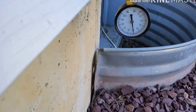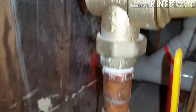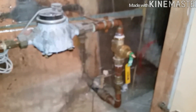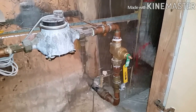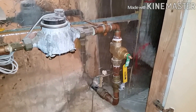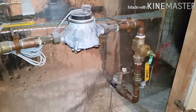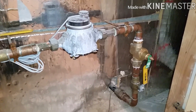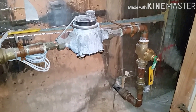That's pretty good, I'm happy with that. Final shot — no leaky-leakies, good to go. So it's around 55 sitting, drops to about 50 with the faucets running, and 48 with other fixtures and toilet flushed — which is good, running around that 50 range with a couple things running. Don't mind my voice — getting over a cold. Alright guys, check you later.